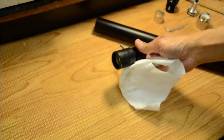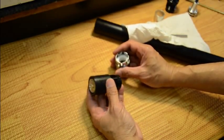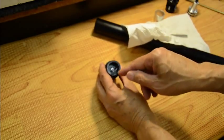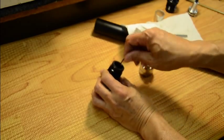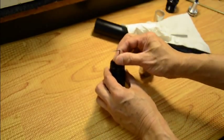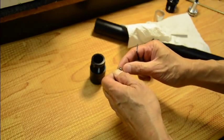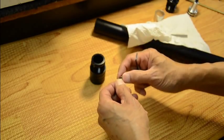I'm going to continue disassembling the fill cap, fill probe assembly, and gauge assembly. Inside the fill assembly is a check valve with an o-ring. If that leaks, you'll dump your pressure. Let me take it out and show you — there it is, the little o-ring.